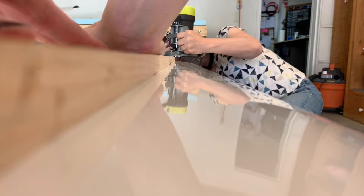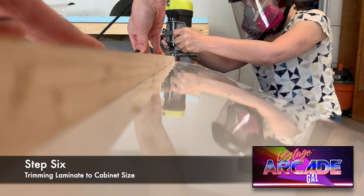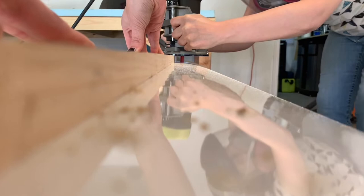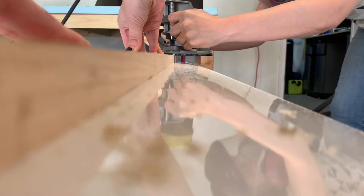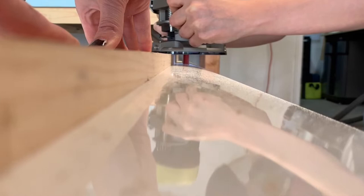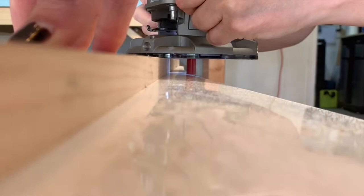You can start trimming pretty soon after adhering the laminate, once you're satisfied with how it's lying. If you're not happy at that point, you're out of luck because it's stuck. Using your flush trim router bit with a router, slowly start trimming to the edge of the cabinet — this is pretty forgiving. We're using a two-by-four as a guide, mainly because our router is fairly inexpensive and didn't get as low as we'd like. The flush trim router bit itself is about $30 and the router is about $40 — not a lot of money, but it worked great. The trimmed edge will be very sharp, so we'll take care of that in a moment.